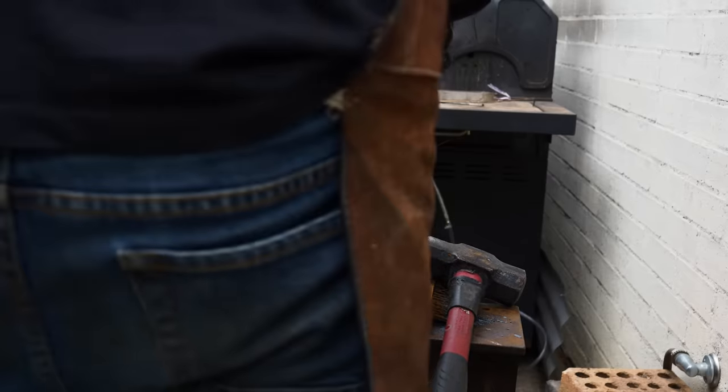After closer inspection, it looks like we've run into a problem — and when I say we, I actually mean me. You probably find my pain enjoyable. It looks like the file has not properly welded into the rest of the metal, and there are some cracks — probably because of the incredible amount of oxidation I built up on the axe. But I reckon it's nothing an artisan of welding like me can't fix. Ignoring that though, the rest of the forge welding seemed to work really well, and the two sides stuck together without a visible seam. I hope those dwarf men are proud.